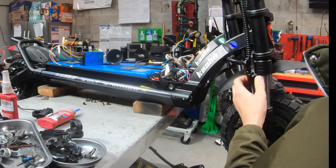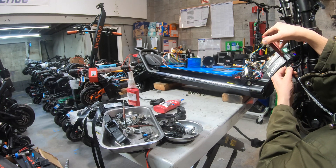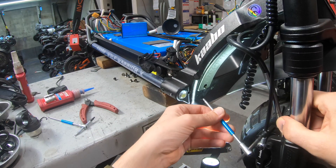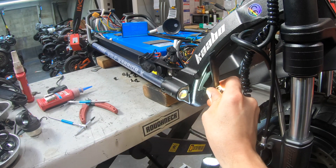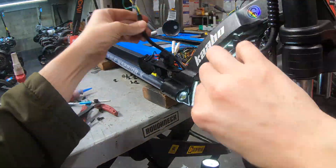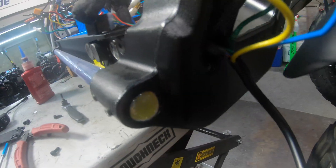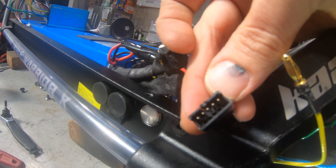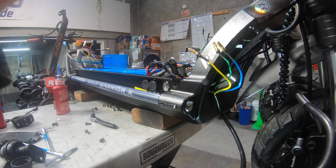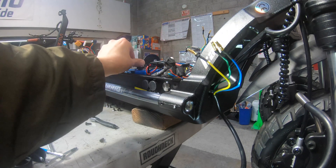To remove the front motor, first we're going to remove this twisty-tie phone cord cable retainer, then cut a couple of zip ties. When you get to these little plastic covers you're going to find that your Allen key probably isn't going to fit in here very well, so a small ratchet and a three millimeter bit can save a lot of time. You'll get to the point where you could almost pull the cable through the hole in the frame, but the black JST connector is just a little bit too big to fit through. While there is a tool for removing these pins from the connector, in this case they've glued the wires in place, so our only option is to cut this connector off. Set it aside to use as a reference when we rebuild it later.